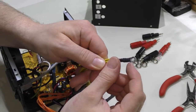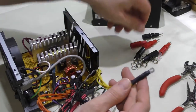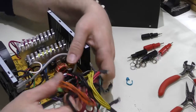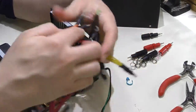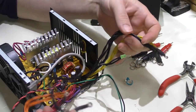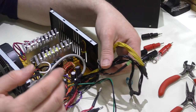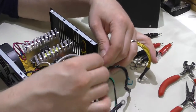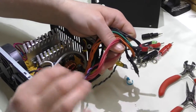That's all apart now. You can see this is all just terminated to ring terminals here, which are really useful, and they just went onto the backs of these little jacks. But this whole spaghetti mess of wires — as neat as you're going to get it. You can see I have one ground wire going specifically to the switch. Some of the newer ones have actually been building a ground bus where all the points go there, and you don't need individual ones for each item.